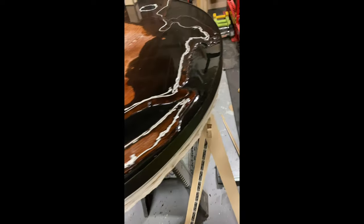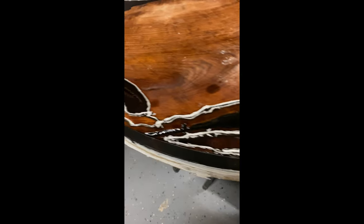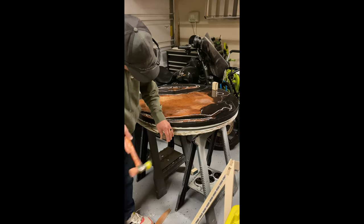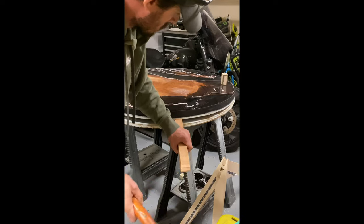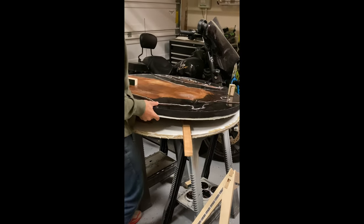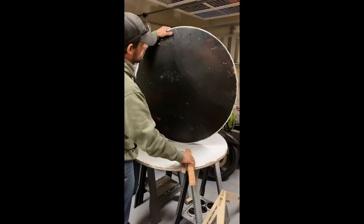Here I'm taking the form off — the epoxy is almost off, just a couple of screws to take out, then I just have to separate it from the base. It's very important to use mold release. As long as you do that it's pretty easy to get these off. If you don't, you're probably going to have to machine it out with a router or something — it would be pretty much a nightmare. So always use mold release. A few bangs to get the edges clear and there we go. Now it's time to flatten it.